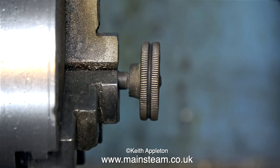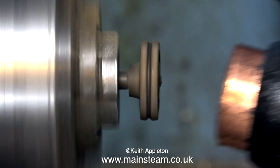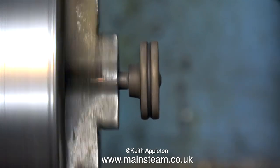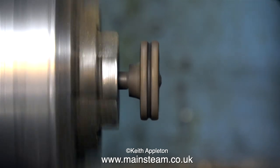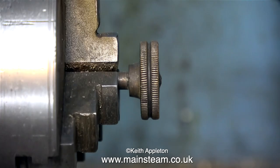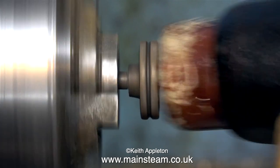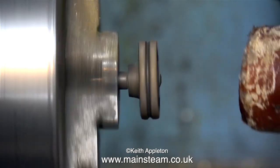Before I do the job properly, here's a health and safety warning: be very careful for a couple of obvious reasons, and don't use the copper side of the hammer — use the hide side of the hammer. The couple of reasons are: if you miss the part and hit the chuck, then the chuck might throw the hammer at you, which is not a good idea. I've done a lot of this so I'm well practiced in the art of straightening things by putting them in the chuck and hitting them with a soft hammer. Before any experts write in — I'm doing it wrong for the video, and as you can see nothing much is happening. I'm hitting it a lot of times in the wrong place: don't hit it from above because you'll put too much pressure on the piece of work.